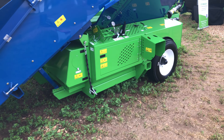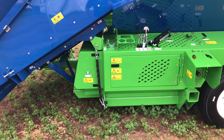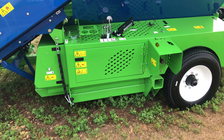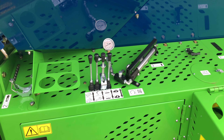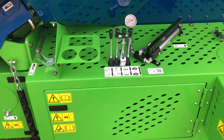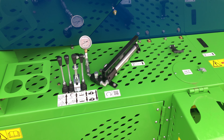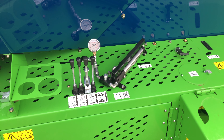Around the front of the machine, the first thing you'll notice is the operator station. All controls are moved to this area and all main service items are done from this one position. The controls are very straightforward — covering the hydraulic lift, the tunnel clean-out, the cable operation, conveyor operation, and raising and lowering of the conveyor. The brake system is also placed here with easy adjustability, so that the operator can maintain the back pressure as needed when working with the machine.